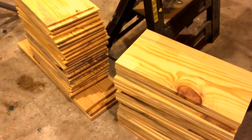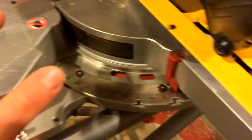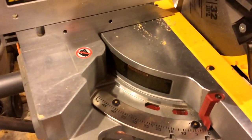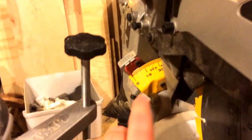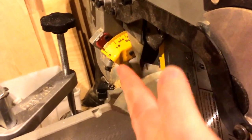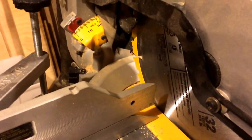So hopefully I've got some good square beekeeping boxes now. I know I rambled — hopefully you all learned. I'm sorry I didn't actually show you loosening the screws, but you don't need me to show you how to loosen screws — very, very simple. I showed you how to change the blade on this saw, and I really appreciate how DeWalt has made it — it's very easy to do. To that end, look at our bevel back here. This saw bevels I think 35 degrees to either side. I have not checked this square as far as up and down — never had a problem with it though. It's probably something I should check now that I found the miter deck was out just a little bit. I should probably definitely check the bevel too, but that's another story.